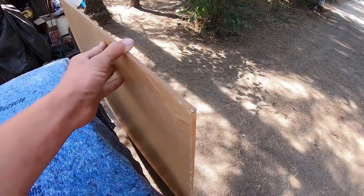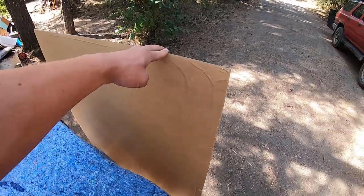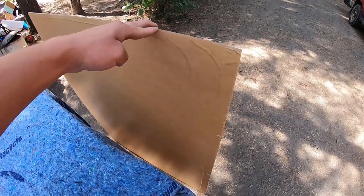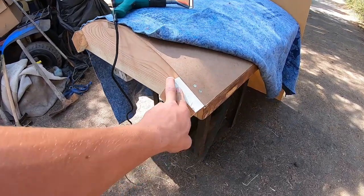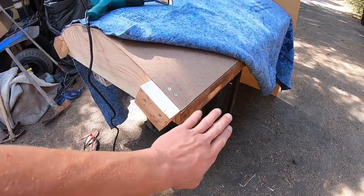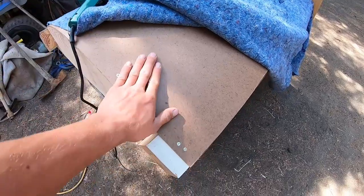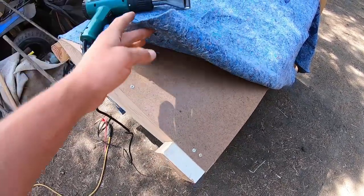be an issue. I believe it's 0.22 inch plexiglass and the whole sheet is 3 feet wide from this perspective and 4 feet tall. So yeah, it's just made from 2x material with 3 strips of 2 inch wide by 3/4 inch thick bits of scrap lumber in 3 places. And then the whole thing is skinned in this, which I've been told is wall paneling.